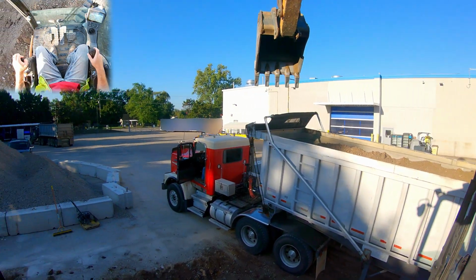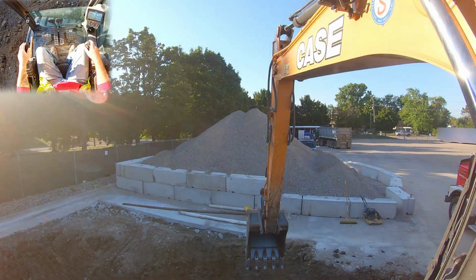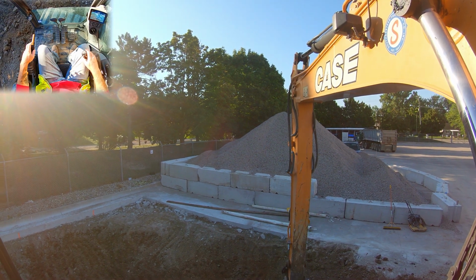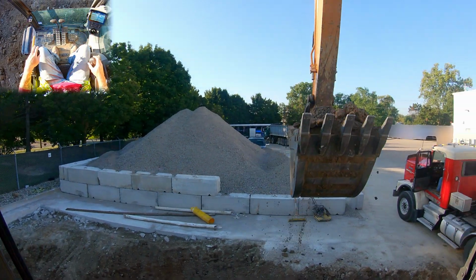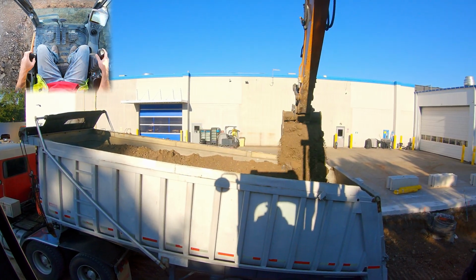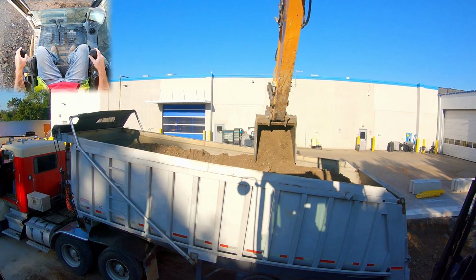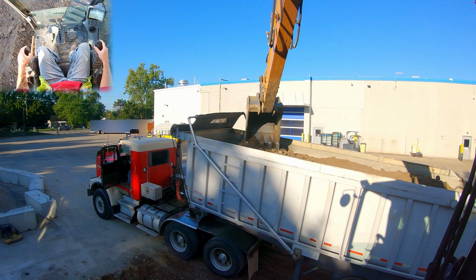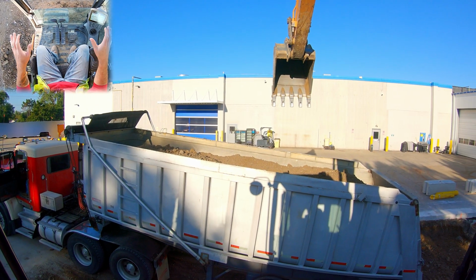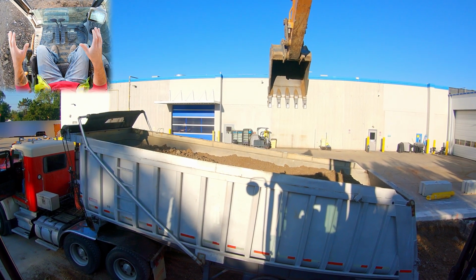And so it's important to know that, because we can't put concrete in an aluminum box. It will rip it to shreds. You don't want to stab your teeth into an aluminum box. You will absolutely punch holes into it. And then you obviously can't clean side rails like you can on a steel box. You have to be very gentle. So it's also a really good thing to know what kind of box you're loading to account for that.